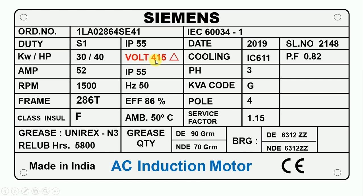By looking at voltage, you can also confirm whether this motor operates on single phase or three phase. In front of voltage, it is written 415 along with a delta symbol. In many motors, no symbol is written — simply voltage 415, meaning the motor operates at 415 volts. But if any symbol is present in front of voltage, you must consider it. If a delta symbol is there, the winding must be connected in delta and we have to provide 415 volts. In some motors, a star symbol is present — then you connect the winding in star and provide the written voltage.